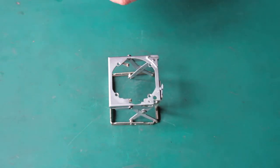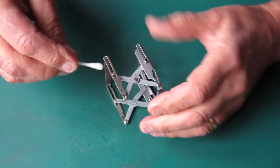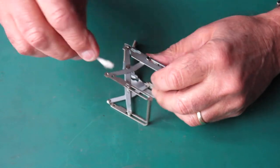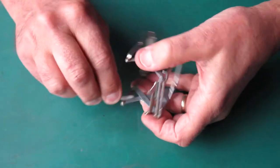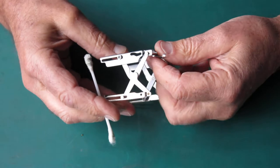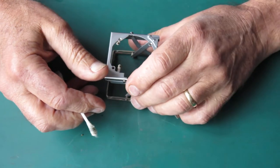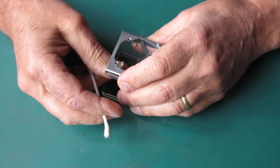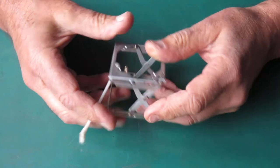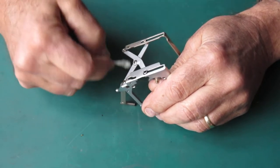The struts. I always clean these first and then inspect them to make sure that everything is straight — pieces that should be straight are straight, pieces that should have a bend have a bend in the correct way, and any dirt is long gone. It's not uncommon for struts to be slightly bent, typically from cameras being dropped, people closing the front without pushing the buttons in first, or closing the door without resetting focus to infinity and still pushing on it.